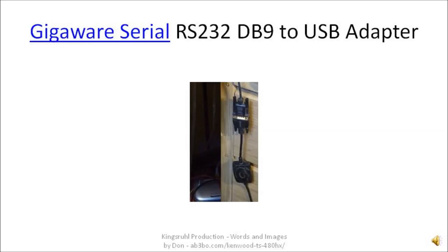In this image there are two items of significance. Number one is a black RS-232 cable on the right hand side with a black module sitting below it. This DB9 cable comes out of the COM port of the radio, and a GigaWare serial adapter takes the DB9 connection and converts it into a USB connection. The USB side goes into the computer.